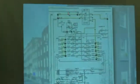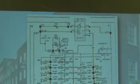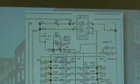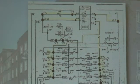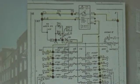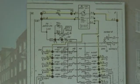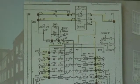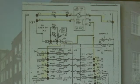Anyway, this kind of shows you how the reset panel operates. In this case, when we go on fire emergency, the FM master picks up C1. When C1 picks up, we send a separate signal to every hall call. It resets everything individually. Boom, boom, boom. We don't rely on any single contact to do the job. That was my experience many years ago, that when we did that, contacts didn't survive. Just didn't work. So we devised that whole panel.